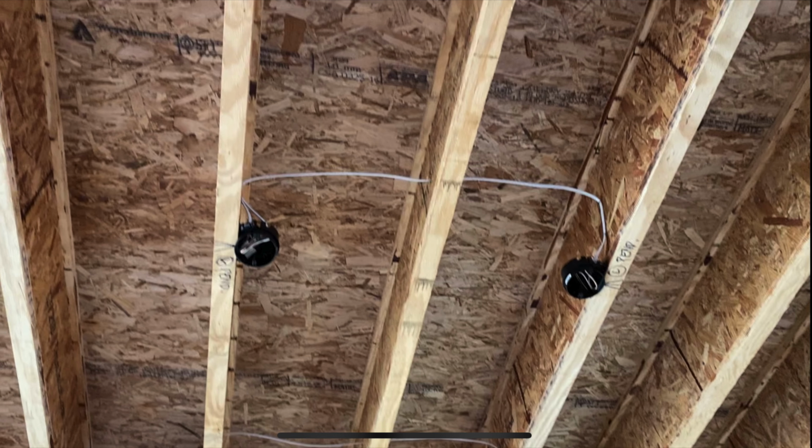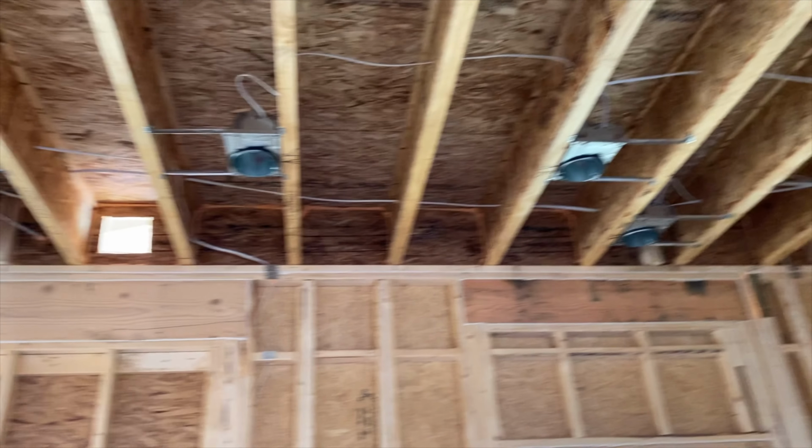Now, looking at the ceiling, what I was told, and this might be different if you're getting a contractor, this might be specific to new builds, this might be specific to my exact builder, so ask questions, make sure that you look around as well. But what I am working with personally is that these pendant lights do need to be attached to the studs here. Some of the can lights, as you can see, have that kind of bracket, so you can move it left and right along those metal brackets. The pendant lights, not so much. They're attached directly to the stud. So my options here are either left or right of that stud, or you have to move completely out to a new stud. Generally, those are about 16 to 24 inches apart, so that makes a huge difference in the placement.